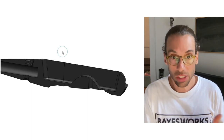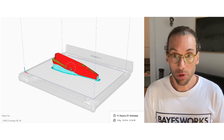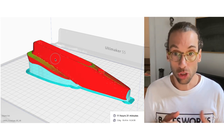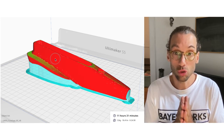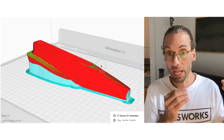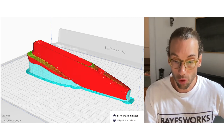For the printing process, I use the Cura software for Ultimaker machines. To maximize strength I print at a specific angle, since the material is stronger along the print direction and weaker across it. The vertical bolt holding the rear fuselage in place ties all those weaker slices together. The blue parts visible in the slicer are simply support structures needed to perform the print.